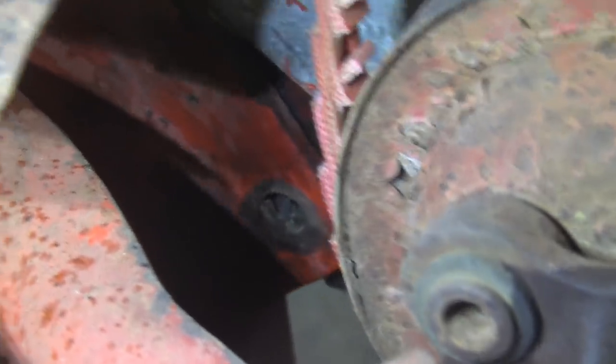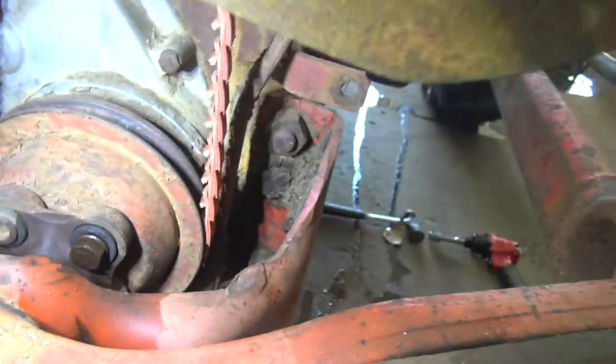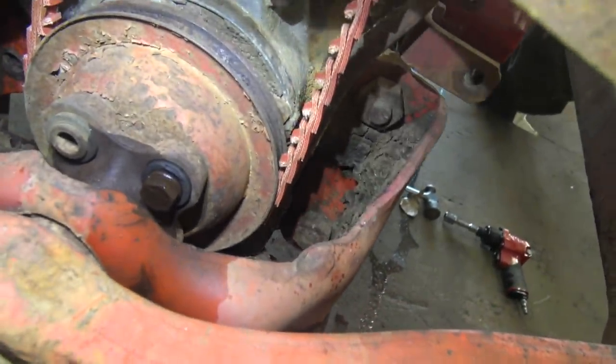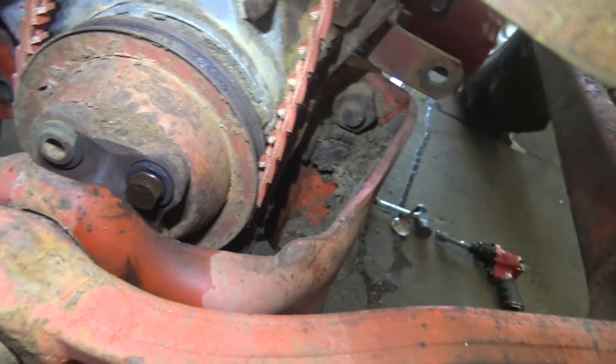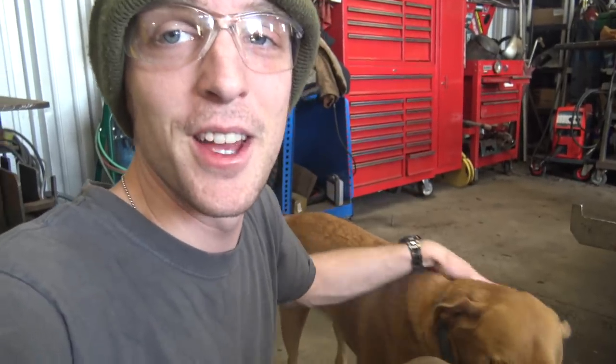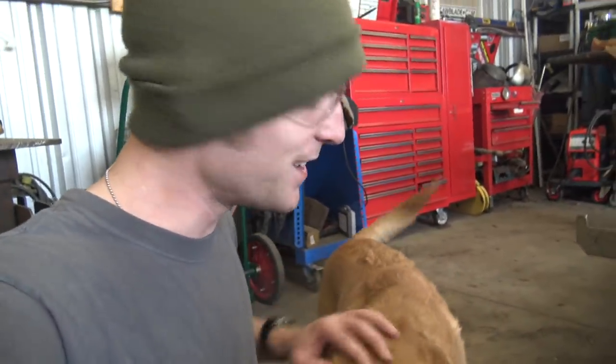And this is the best surprise so far, as you can see. There used to be one bolt down there, and another one there, but they're gone. So as you can tell, the entire front end of this tractor is literally held on by those two bolts. That's it. This is why I made a video probably a week or so ago, and in it I said, and say it with me folks, with old tractors and farm equipment, you cannot assume anything. I mean, nothing at all.